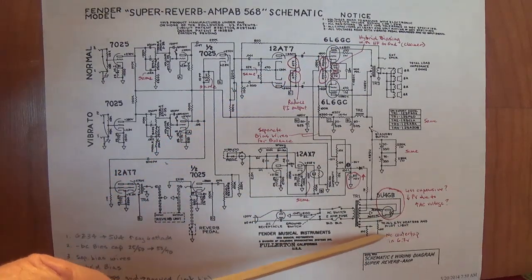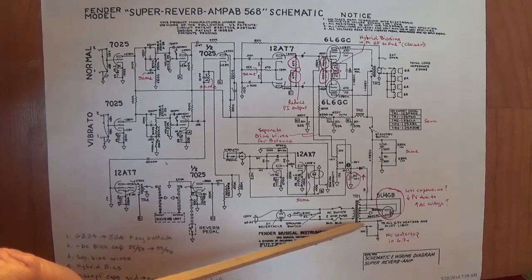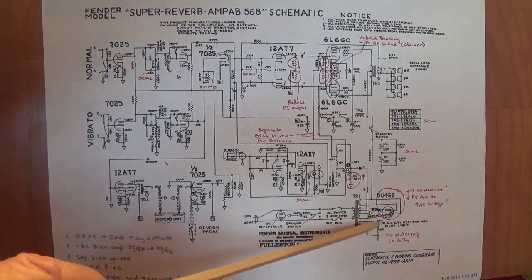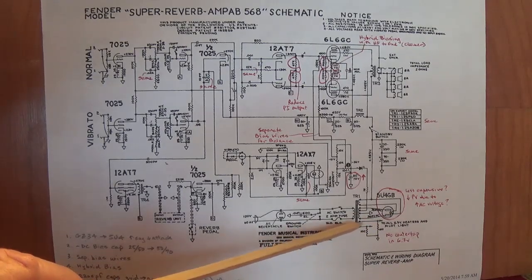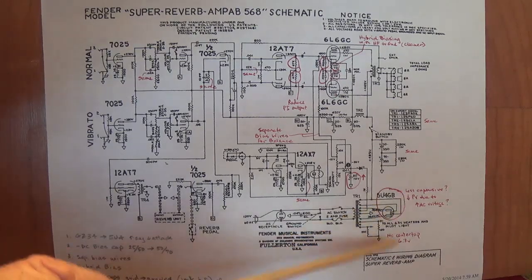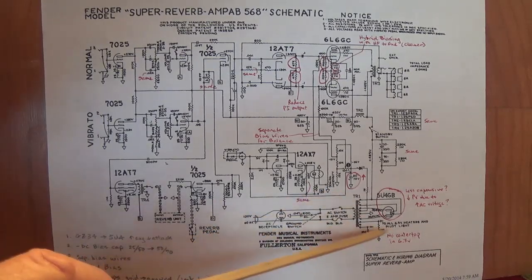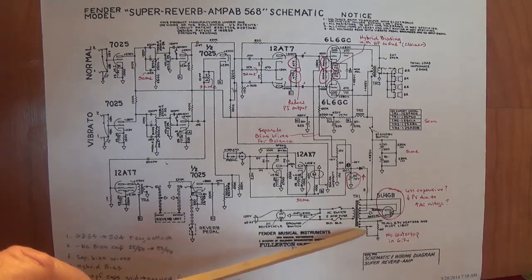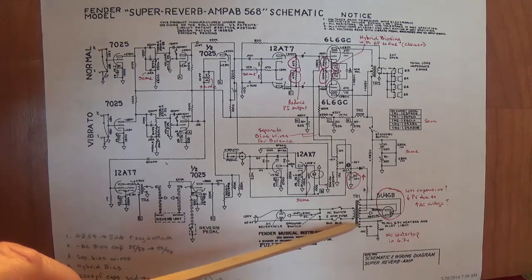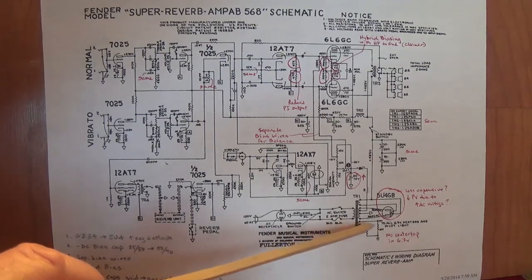One final change they made is we see that there's no more center tap on our 6.3 volt winding for our filaments. Instead, they've gone to the virtual center tap. I think you'll find if you look at your transformer, the center tap is there. They've just chosen to block it off and tape the end, and they've gone with these 100 ohm virtual center tap resistors. Now, there's an advantage to this in that if you have a short in your filament circuit, these are like fuses. They will be sacrificed. They will burn and open, hopefully before the winding is destroyed in the power transformer. So these give you some margin of safety that the grounded center tap does not.